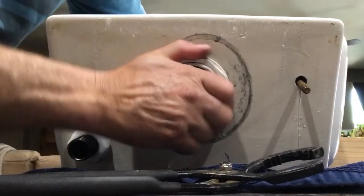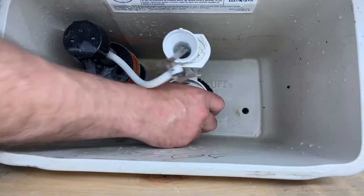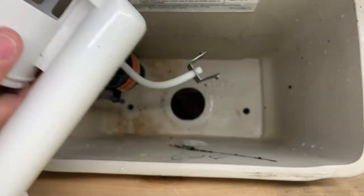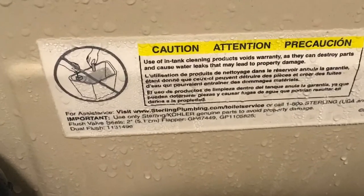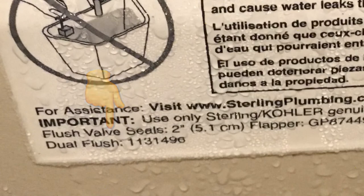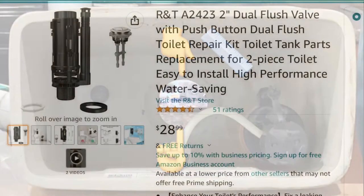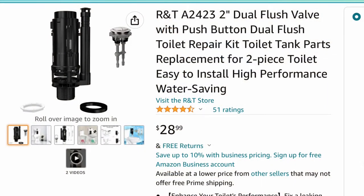This would be a good item to order by application. I actually went and grabbed one from Lowe's figuring they'd have the most common size — I ended up buying a 3-inch and I actually needed a 2-inch for my toilet. So I ended up doing this job twice and returning that one to Lowe's and ordering one off of Amazon. After looking closer, there was a tag inside the tank of my toilet that verified it was a 2-inch flush valve. Apparently there are two main sizes: 2-inch and 3-inch. If you can't find the tag, you could just measure the hole in the bottom of your tank — when I measured mine it was 2.5 inches and that was for a 2-inch flush valve, so I'm guessing it would measure closer to 3.5 inches for a 3-inch.